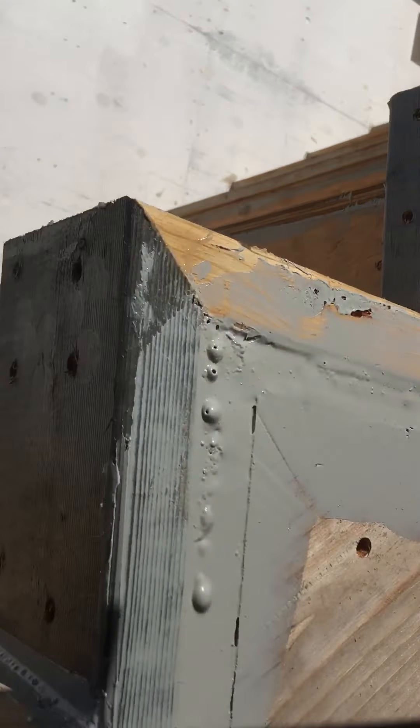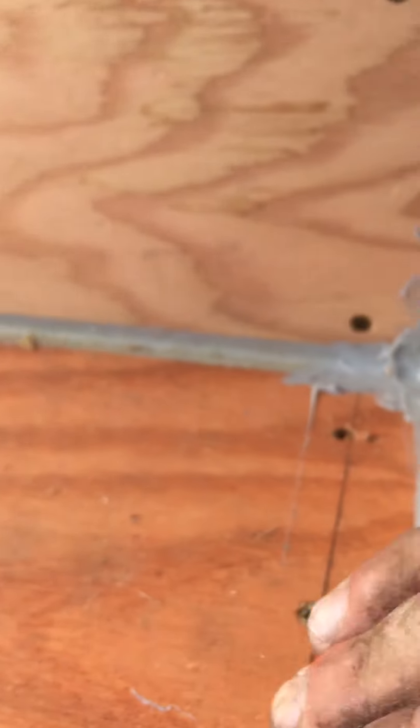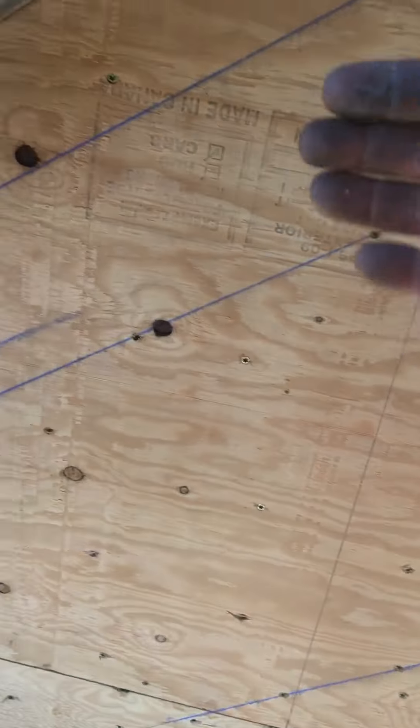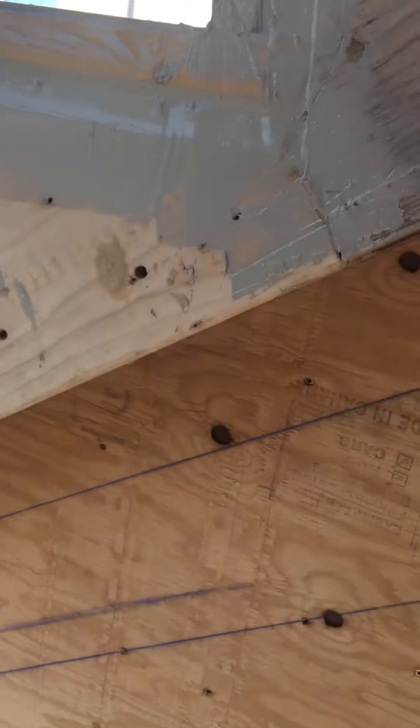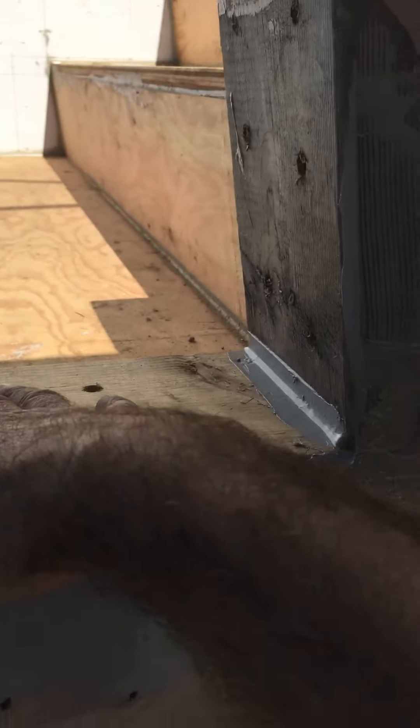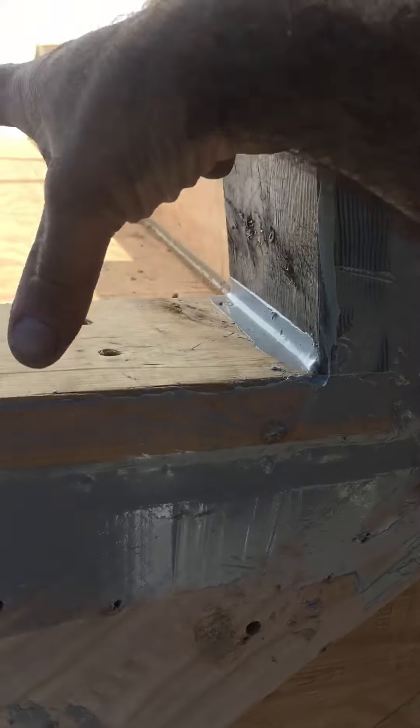We just finished setting this blocking — you can see it's inch and a half — because we're gonna put rubber, then sleeper, and some decking, and that's gonna conceal the edge of the decking. This gets five inches of insulation called the thermal bridge barrier. It builds out to this point and then it's sculpted siding. Then fiberglass runs up here and folds over on top of this curb. The rubber comes down these stairs along the roof and folds up on top of this, which seals the curb. Then a metal coping comes over the top after that and finishes this off.